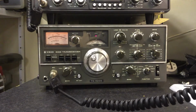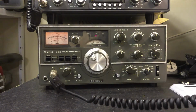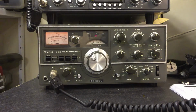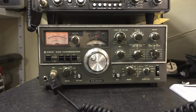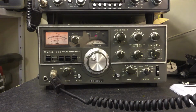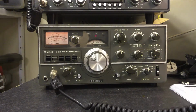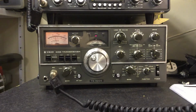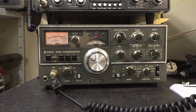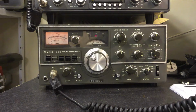Yeah, Golf 4 Yankee Charlie Alpha, Mike 0 Juliet Charlie Foxtrot. Well, very good evening to you, Peter, and sounding good. It's interesting that on your last QSO I was listening, and you were like 20 over the 9, and just as you were signing off, you dropped right down towards my noise floor of around S6, S7, and I heard you talking about noise on the lower bands, and I was going to jump in and say, yeah, noise not too bad down here, considering I'm sort of 15 miles from London. You're 5 and 9 plus 10 at the moment, so you came back up out of the noise when you replied to me, and you're sitting around the plus 10 yourself on the peaks, and dropping just below the 9s on a little bit of QSB.